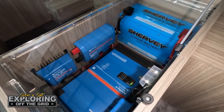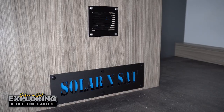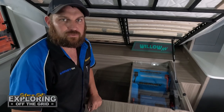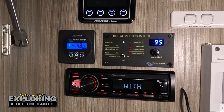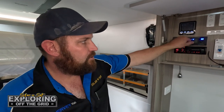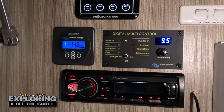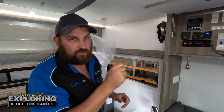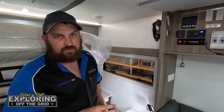We've also installed a clear acrylic lid — that draws cold air into the system and lets the fans of the Multi Plus push the hot air out, keeping it circulating and the system cool. In here we've got the inverter brains — that's a digital multi control — which allows you to turn the inverter on and off and adjust your current limits. If you're running off a generator you can dial it right down to 9.5, 10, or 15 amps so you're not triggering any circuit breaker faults.